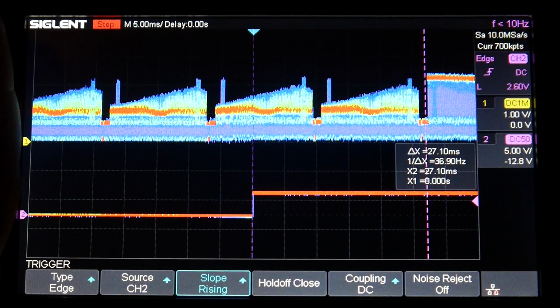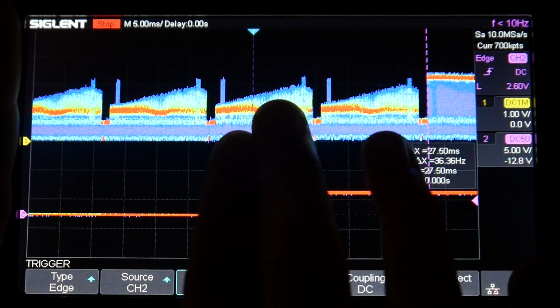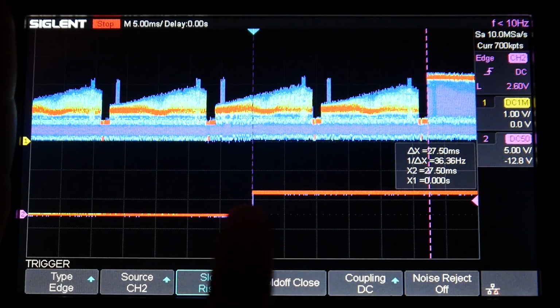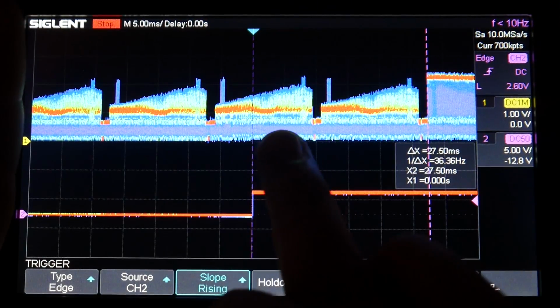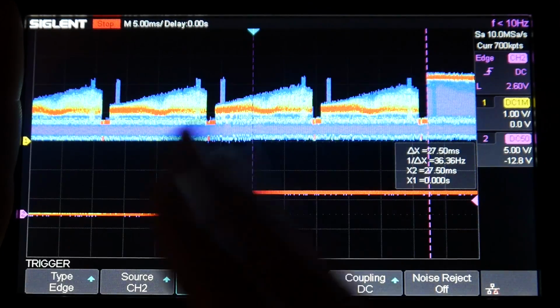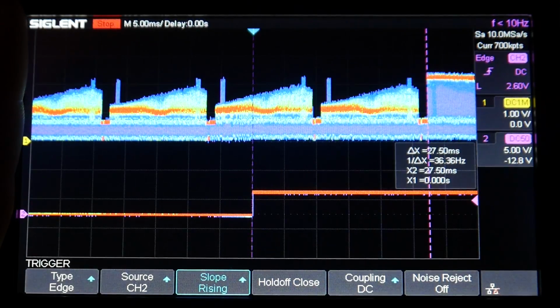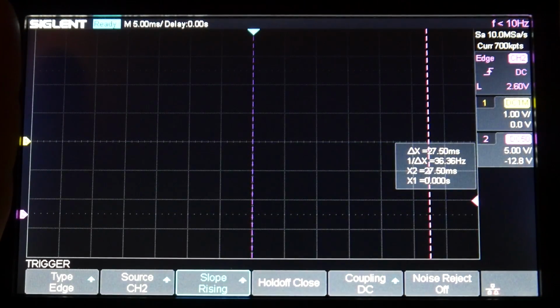This was the most latency it actually got. Look at this. What is that? Around 27 milliseconds. So that wasn't really good. So as you can tell here, each one of these is half a frame because they're interlaced frames. And the LED turned on between, let's just say, the first half of the frame right there. It didn't register on the second half of the frame because again, these two are basically a frame. And then it registered on, we could say, the second frame over. So let's go ahead and take another reading here. So that was 27 milliseconds.